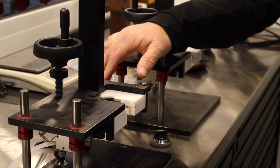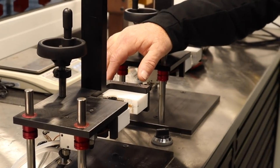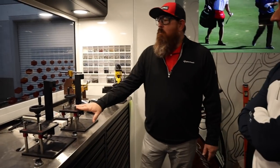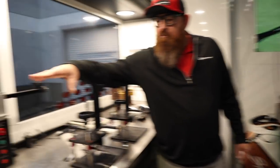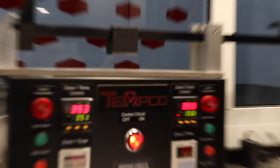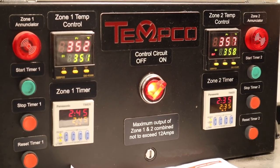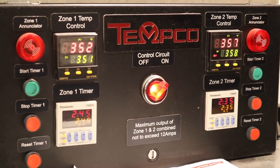When I first came out here in 2000 we were using five-minute epoxy, and I thought that was horrible. I've been with TaylorMade since '87. Probably around '95 I did a lot of work inside the office on temperature and time. So we use 24-hour epoxy and we put it inside this curing cell, which is about 350 degrees — that 24-hour epoxy gets accelerated to cure in two and a half minutes.